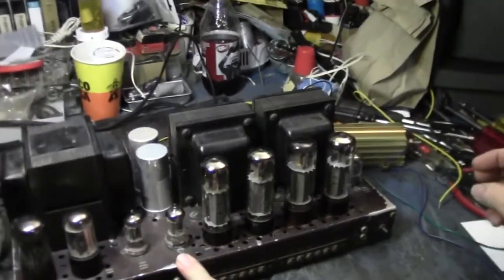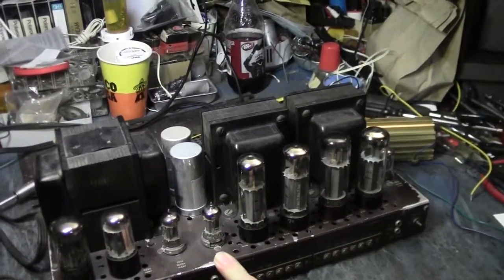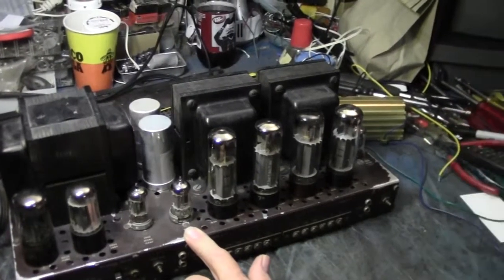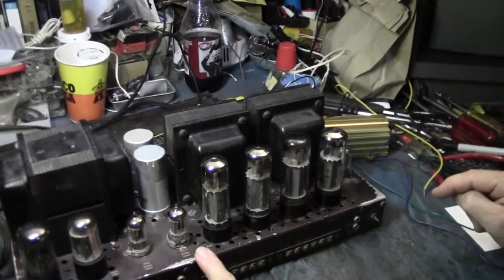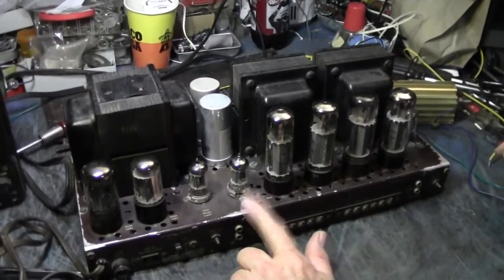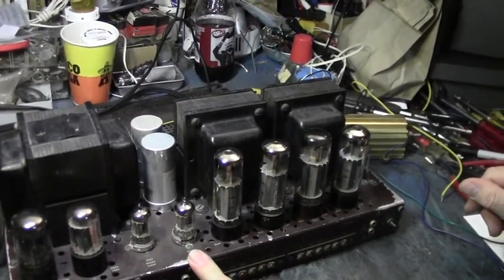There's another interesting thing: this has a double triode preamp stage with the tubes in parallel — they really should have used a bigger tube. You've got a triode driving a DC-coupled phase inverter. It's got a funny-looking phase inverter circuit, and you have to study the schematic closely to realize it's technically a grounded-grid amplifier feeding the second tube, which gives you an effective 180-degree inversion of the signal. The output transformer corrects the phasing. Usually you'd just use an extra tube for that phase inversion, but this is a very tricky circuit, and resistor values are absolutely critical because it's a DC-coupled amplifier.